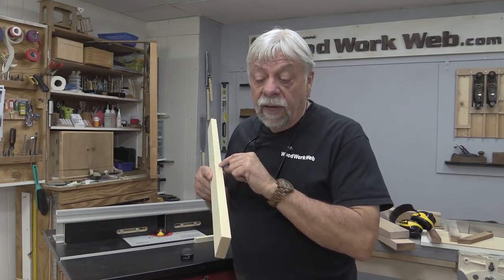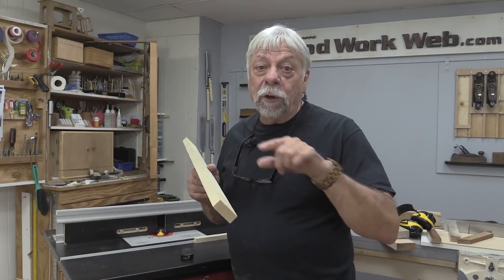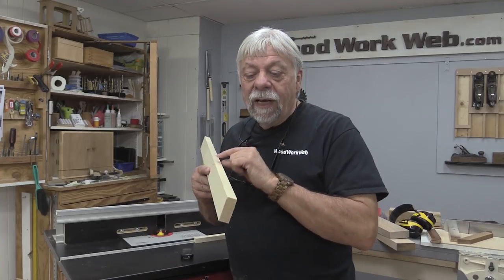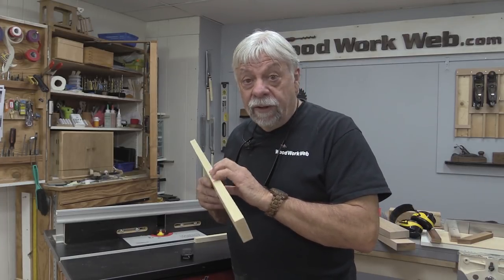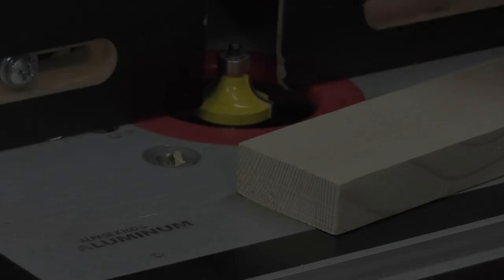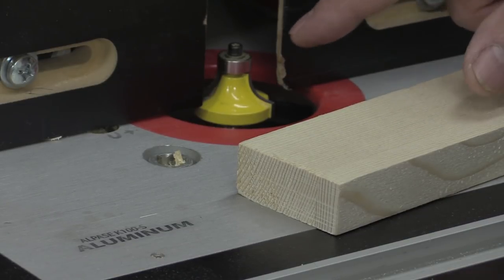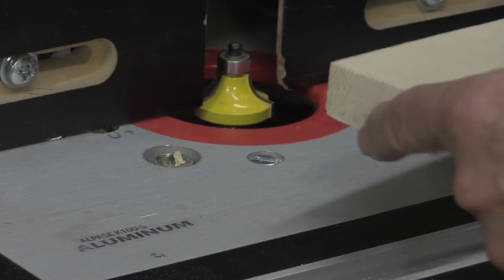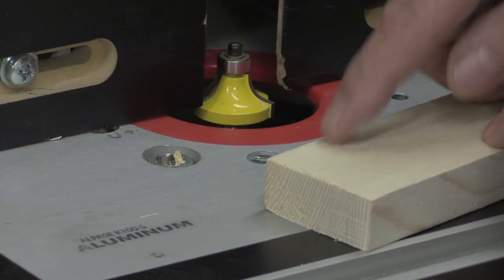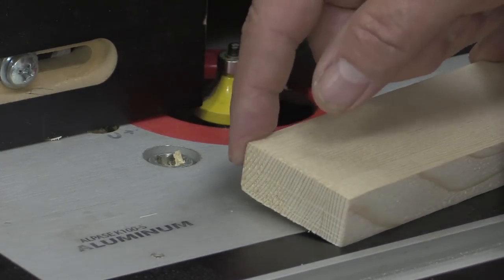Let me show you what we start off with — the straightest grain of wood you can get, because doweling is always the best wood you can find. If you look in the hardware store you'll notice that the doweling is always perfect grain. I've already set a router bit in my router table. There's the router bit I'm using — it's a quarter-round bit, three-quarter inch, and to make a three-quarter inch dowel I need to use stock that's three-quarters of an inch thick, which is exactly what I'm using.